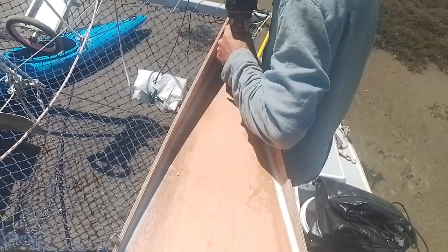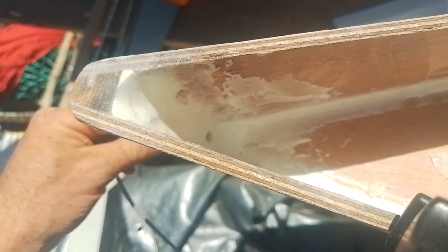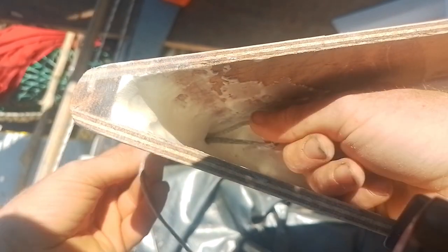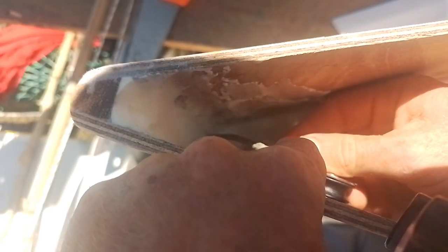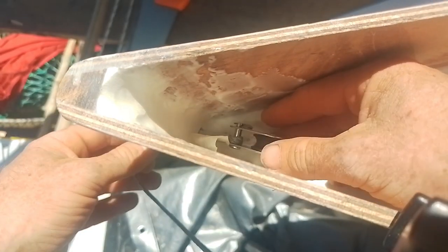I'm installing soft chain plates for the shunt line. This is used to pull the sail to either end. I'm just epoxying in a loop of Dyneema-type rope, ultra-high molecular weight polyethylene, also known by the brand names Spectra and Dyneema. But of course, my rope here isn't Spectra or Dyneema, it's very cheap UHMWPE that I bought on AliExpress. It's stronger than steel wire of the same diameter. This stuff is left over from re-rigging my Kilo, in which I did a lap of the North Island a few years back.